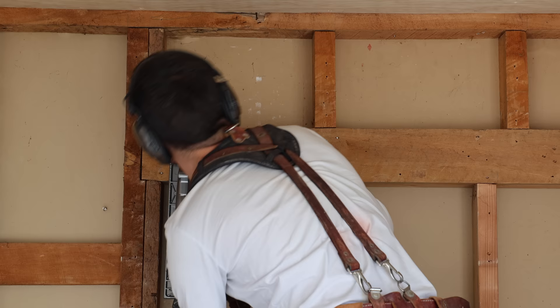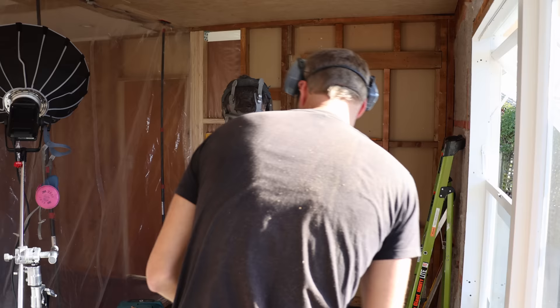So yeah, so far you can see it's kind of simple, right? It's just a wall frame built continuously and the floor is built continuously so the bolts can go into it — the wall and the floor are all connected. But sometimes, especially with this renovation, the walls have been built to a standard that doesn't suit bracing, so you have to come up with solutions.